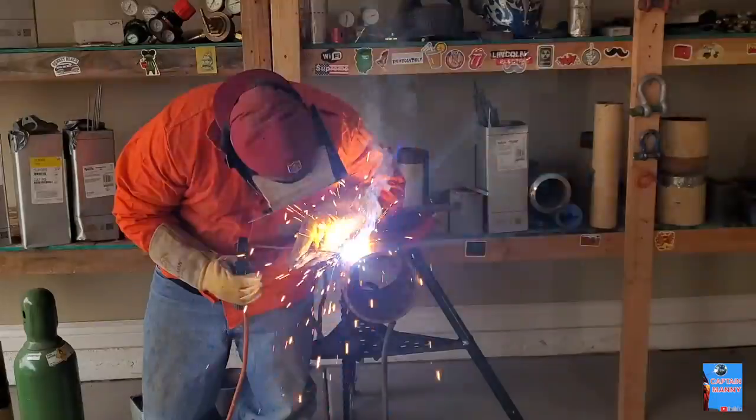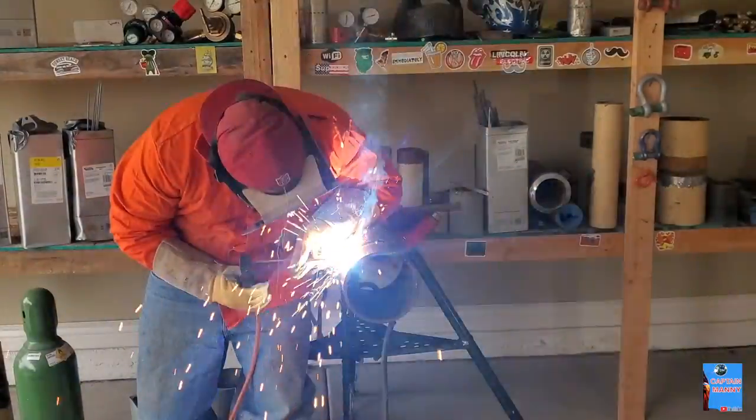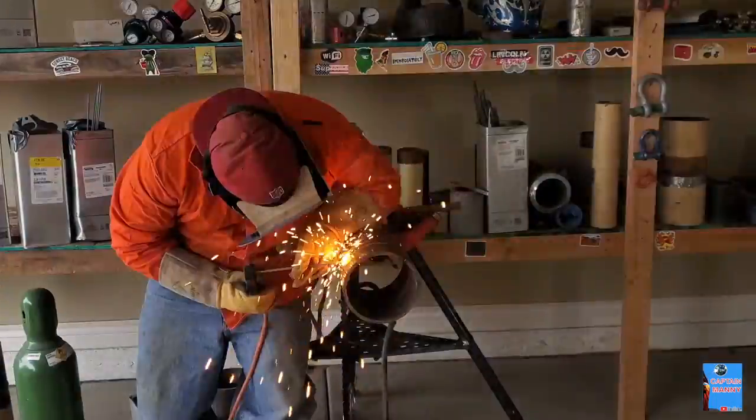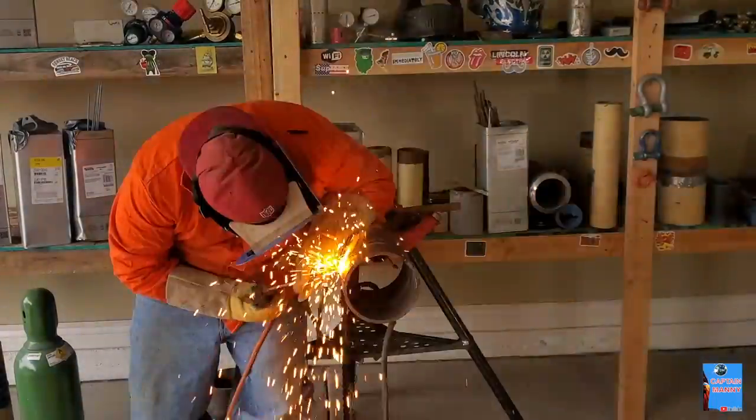So like I said, 1/8, third gear, and start at 30, then go up and down depending on how you see the puddle run for the hot pass. And then after that we're probably gonna use a fill too. All right,